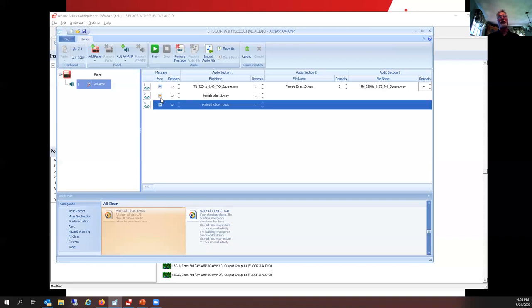But what you're basically going to do is bring your DC power from your power supply into amp number one. Because it's a 4-pin terminal, plus and minus in, plus and minus out, you come out of that and go down to the second amplifier, plus and minus in, and then you've got your juice for it there. As far as the addressing on that, whatever you're attaching it to, you simply bring the P bus into the 485 inputs, in and out, in and out, in and out, either the pen or the panel itself, whatever you're hooking it to.